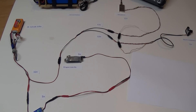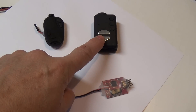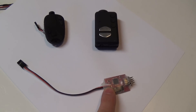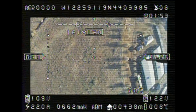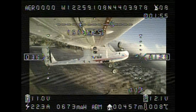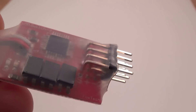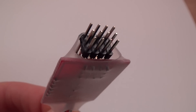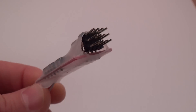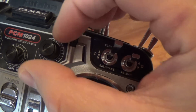Now we're going to take this basic setup and add two more cameras to be mounted on our wing, and we're also going to add a camera switcher so we can switch to the live view of any of these three cameras during flight. Watch how easy this is. The heart of the system is this three-way remote camera switcher. It simply plugs into your receiver and will allow you to hook up anywhere from one to three cameras and switch between them easily from the ground with an extra channel on your radio.